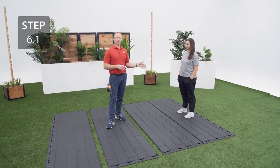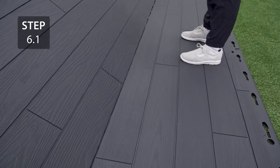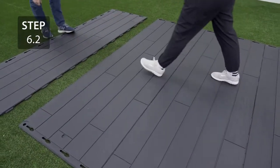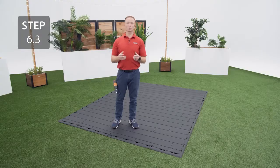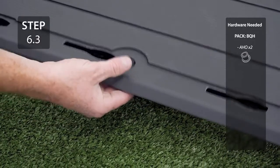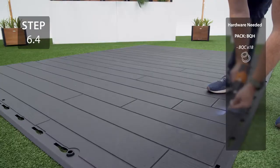We're going to put the floor panel together. With the help of another person, have them stand on the floor panel while the other person lifts the floor panel up, interlocks the tabs, and then lays it back on the floor. The doors can go on either short edge, so decide which edge you want them to go on and place the bushings into the circular holes. Secure the 4 panels together by screwing through the divots on each edge of the floor panel.